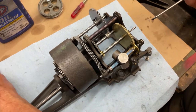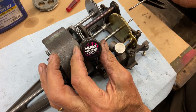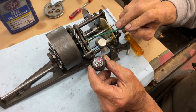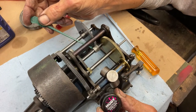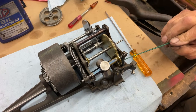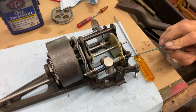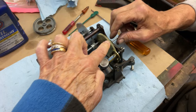On brass to steel you want to use this — I get this off Amazon. You're going to use a little Starbucks stopper. Turn the motor on, dip this in, and then coat this like this while it's running. Then come back and do the one back here because that one's aluminum. For steel to steel — because this gear runs a lot faster than this brass gear — we're going to run STP because it's going to stay onto the gear and it's also going to quiet the noise down on the machine.